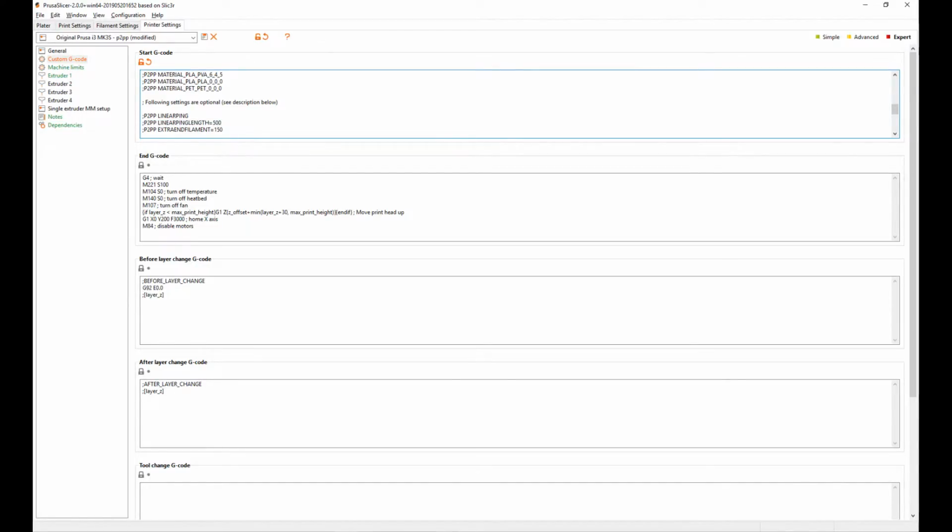For my printer, having them very tight isn't causing any ill effect, but every time it pings, it has to flush the printer's pre-planning buffer. That's a buffer it uses to smooth out the time it takes to calculate stepper motor instructions from actual G-code instructions. So when it's told to go from A to B at a certain acceleration, there is a bit of processing going on, so it might not be able to do that quick enough to keep the stepper motors running smooth. So there's one process calculating the high-level G-code and generating low-level instructions for the stepper motors, which is then put into a buffer and executed by a low-level loop that will ensure the motors are always running smooth.